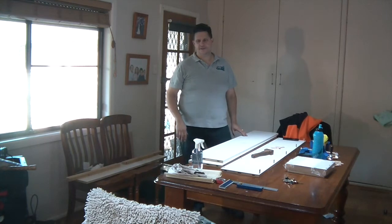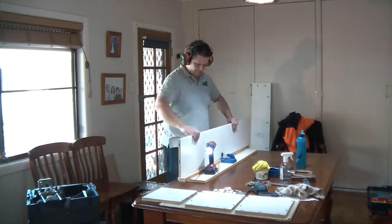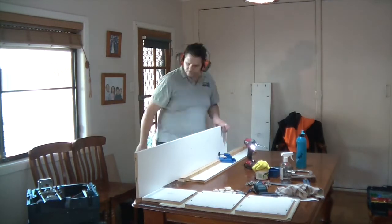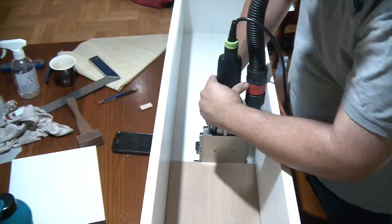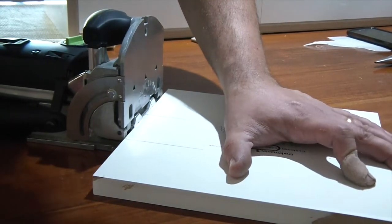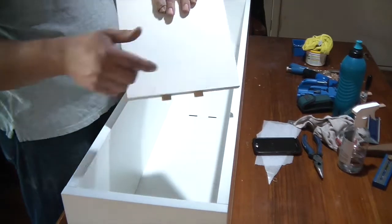I'm just going to make myself a cup of coffee first. Okay, coffee in hand and we're ready to go. What you're seeing me do here is create the pocket holes in the carcasses — just making the boxes that go on the wall and the ones that go on the floor — using a combination of pocket screws and dominos. I'm setting the middle shelf using the domino with a spacer block and the table, and if you get this just right you'll get a dead center.